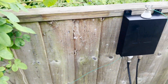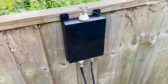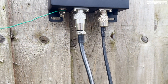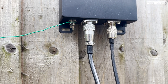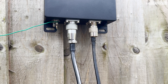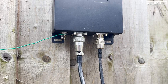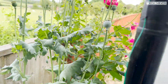Here you can see I've attached the MAT40 tuner to the fence at the end of my garden. I'm using some ultra-thin but very strong green wire from SOTA Beams here in the UK. At the bottom I have some more green wire going off to a copper ground spike. While I know this is not really adequate earthing for this type of antenna, this is a temporary install just for this test. The control cable is connected and runs all the way back to the shack, connected directly to my ICOM 7300, and the 50 ohm feeder coax also goes directly to my ICOM 7300.